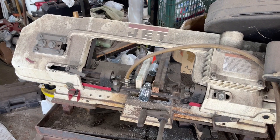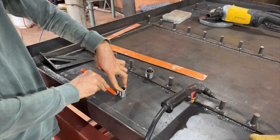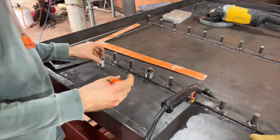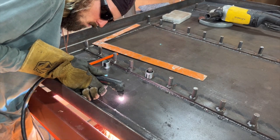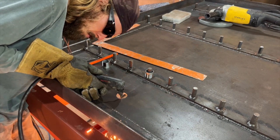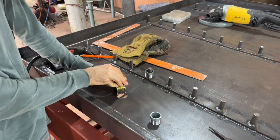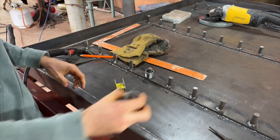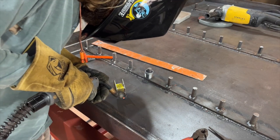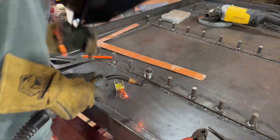We're on to the segment where we're putting in the drain on the table. I'm using a piece of one inch galvanized threaded pipe, cut in half so there's a spot to weld it on more conveniently. Marking it out and using a little Hypertherm 30 amp plasma cutter for this — cut out the circle, check the fit, and ready to weld it in place. I'm using a Strong Hands magnet, one of their smallest 20 pound magnets, which holds it really well. Getting some tacks on it before welding it out and grinding it flush.